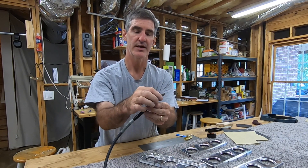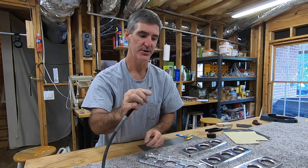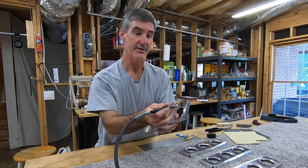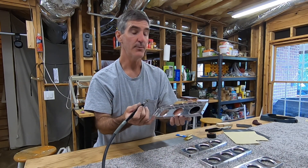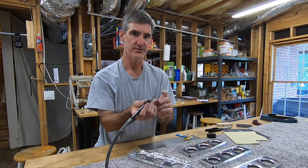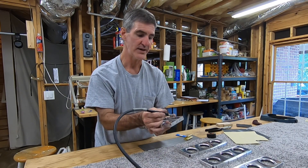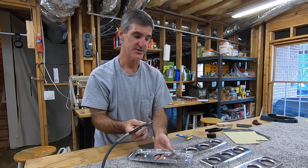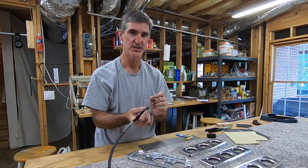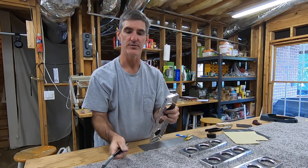What I've been doing up to this point was using a tip I got off one of Plain Lady's videos, which is a great tip. You make a little wedge shape out of a piece of 3M wheel, cut those wedges out, put them on a mandrel, put it in your Dremel or drill, and then you can kind of get down in there — that works pretty well. But the problem is the tip is pretty pointy and therefore wears away pretty quickly. You can watch it disintegrate with each notch, and you end up going through a bunch of them or having to keep fixing the shape of the tip. The other thing is I don't do a very good job with this on the straight parts of the notches.